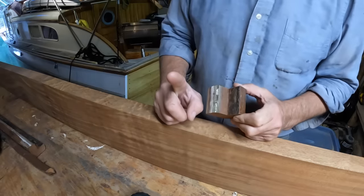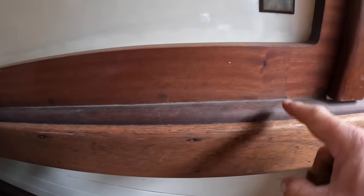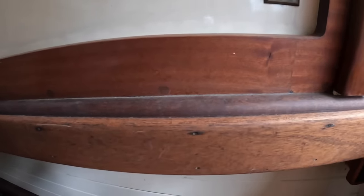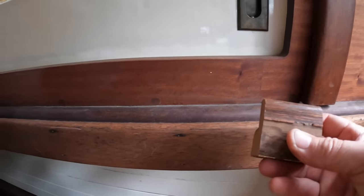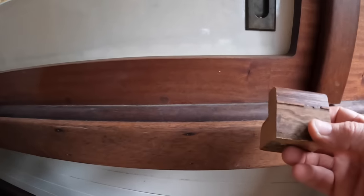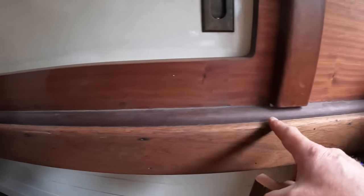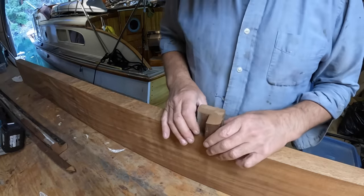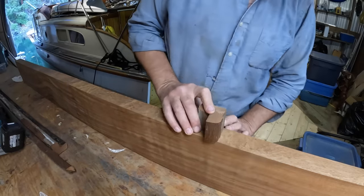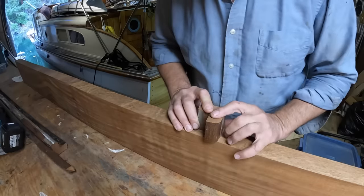That got me to thinking. A couple of years ago, when the same repair was done on the port side, this piece is actually quite a bit shorter than it should have been, as you can see in the one in my hand from the starboard side. So that fellow cut the wood out this way and just let that be as tall as it could. I always wondered why that didn't fit right. As a result, I'm going to do exactly the same thing — if I set the bevel flush with the bottom, it's on a slight angle and it helps adjust a little bit.